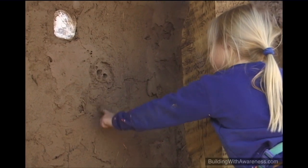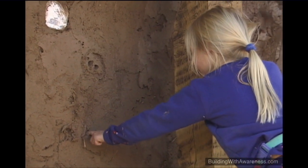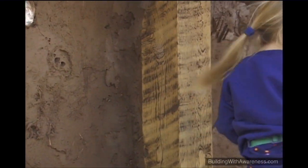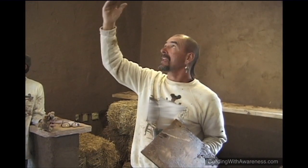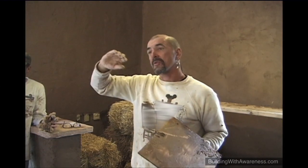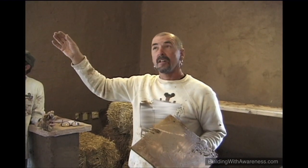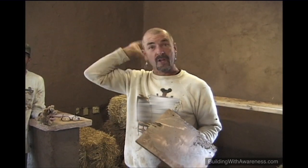The mud has so much moisture in it — people forget that. The moisture rises due to heat up to the top, and if you have drywall or any type of wood decking, the next couple of days you'll come in and it'll be dripping wet. So you need to open all the doors and windows every day until the mud dries. At night, have a couple of windows open with a fan and cross-ventilate.